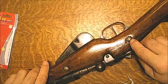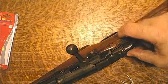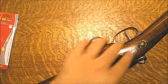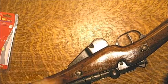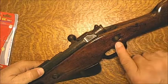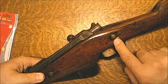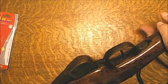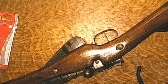Now, I believe the other one was removed as well, because you are not supposed to have any. That bolt head should not be proud. It should be flat. It should be even. And when these are put in correctly, they should be even like this one is, and not like that one is. And so I believe when whoever boogered up the stock took the stock off to lacquer it, they over tightened this. In fact, it looks like it might have. Yeah. So you can see they crushed the side of the stock a little bit when they were putting it in. So I think they really over tightened it. But now it's got at least all the minimum necessary number of parts that if I wanted to put around in this and try to fire it, I think I could. So I will keep everybody informed of how I do with this.